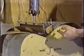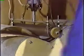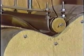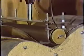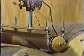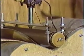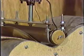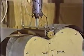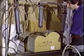Now I'll give it a little pressure and I'll just let it set there until the heat forces the unit into the right position. As you can see, this cylinder is forcing the center down. Okay, now we're going to let it set for a minute or so and basically cook the wood. We're heating the fibers, and the fibers are becoming loose. They're composed of lignin, and the material begins to soften and flex, and then we'll apply pressure and force it into the waist bend.